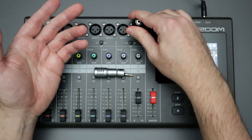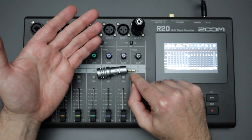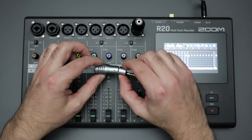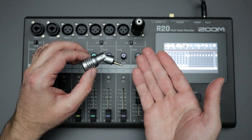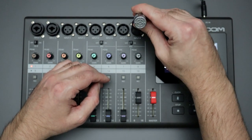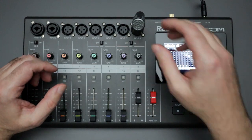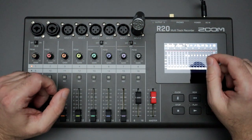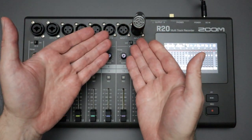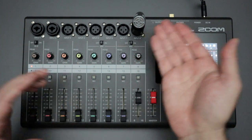It works fairly well. You can use different types of condenser microphones — largely if you get them with a TRS connection, the ones designed to work for DSLR or mirrorless cameras. In theory any of them should work. I recommend getting ones with a bendable neck so you can direct and point the microphone, pick up the signal a little stronger and clearer, and give yourself the flexible freedom that comes with having a built-in mic. If you miss a built-in mic, leave a comment below. Let me know what you think about the quality of this mic versus the R8 or H1N, and whether you have interest in making a built-in mic for a mixing board or a unit like the R20 or R12 for about $20.